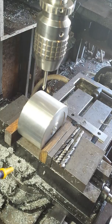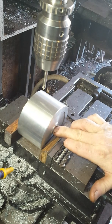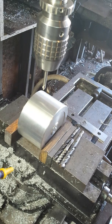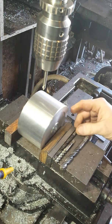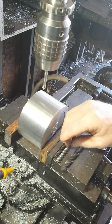Now that we've got center, we're ready to drill this out and tap it. We know this is a 4 inch wheel. This is a 5/8" ID hole in the center, so that is gonna leave 1.375 to the edge of this hole. What I do, I'm gonna drill down 1 inch with a 3/8" bit, and then I'm gonna change over and drill and tap for the set screw.